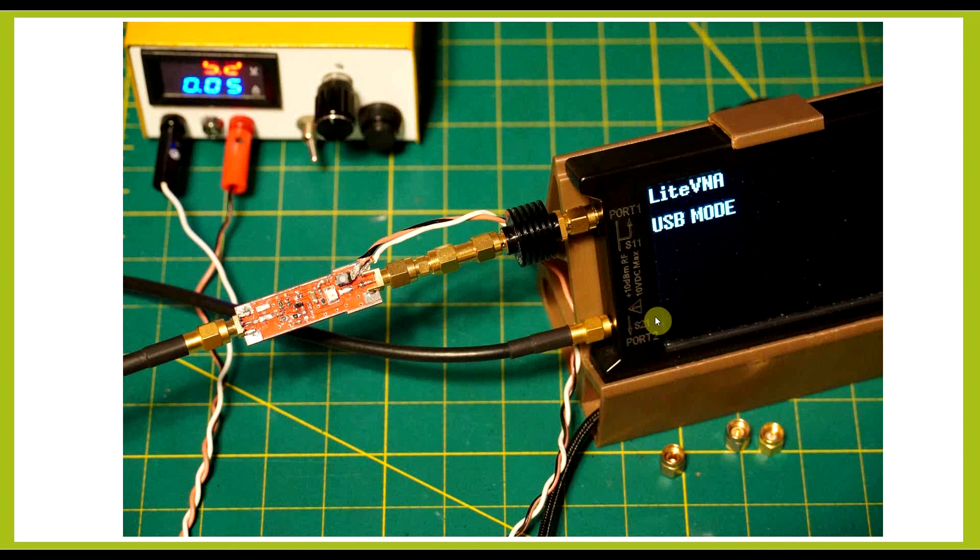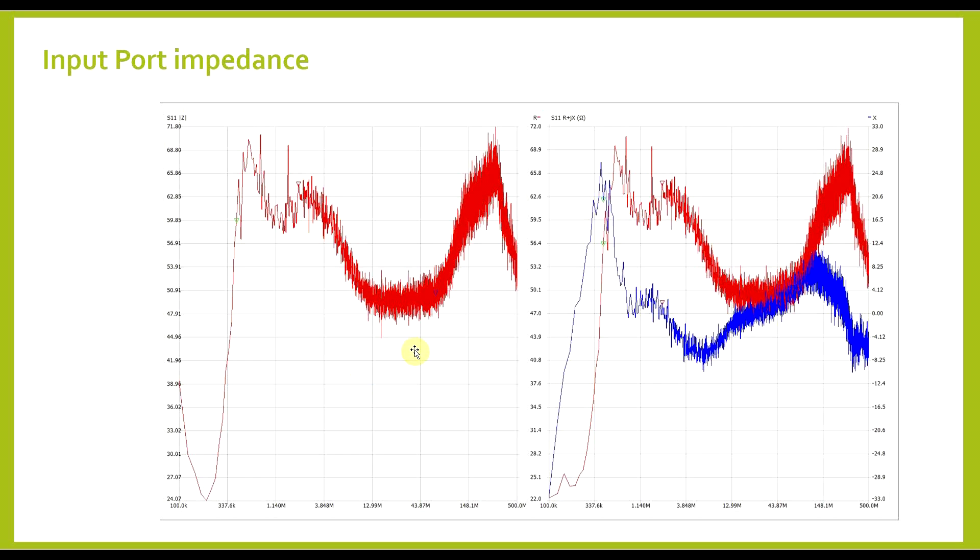For the next experiments I used a lightweight VNA to perform measurements. The first thing to mention is that I had to add an attenuator on the output of port 1 to limit the injected signal. Since this is a small signal amplifier, if the injected measurement signal is too great it will get distorted and generate false results — that is why I used a 20 dB attenuator before the amplifier. Looking at the actual results, starting with impedances, I plotted both the absolute impedance and the real and reactive parts. The input impedance is quite noisy because of the attenuator, and there seems to be some measurement error at the beginning, but afterwards the measured value is fairly close to the 50 ohms we were supposed to be getting.